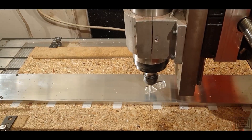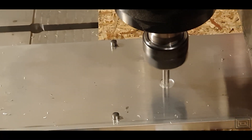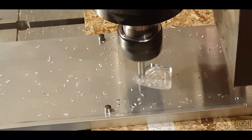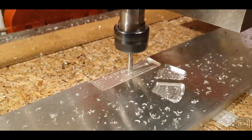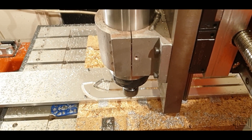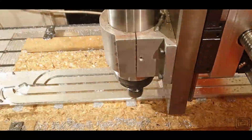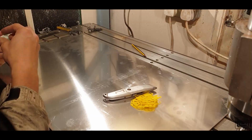The braces themselves are made of 5000 series aluminium alloy. The CAM data says it's supposed to be about a 2mm depth of pass at about a metre per minute, but in reality I'm probably doing about 0.2mm depth of cut at maybe 3 to 5 metres per minute. I normally go for helical ramping, which I think works well — and since changing to servos and making the look-ahead in Mach 3 much higher, the helical pattern works well for me.